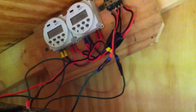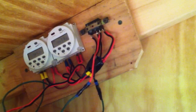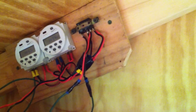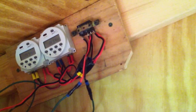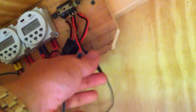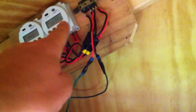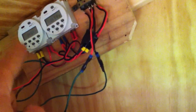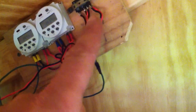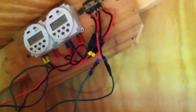The nice thing is it's bombproof and pretty simple. I don't know much about electronics, but wiring the relay as an H-bridge: you just make an X between the normally closed and normally open contacts, then run the wires from the common down to the linear actuator. Then you wire the timer to the coil — the timer drives the relay, you wire power to one side of the relay, and that's it. Pretty simple, and hopefully it works pretty well.